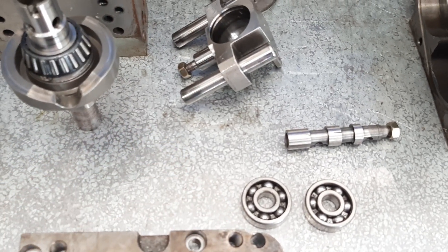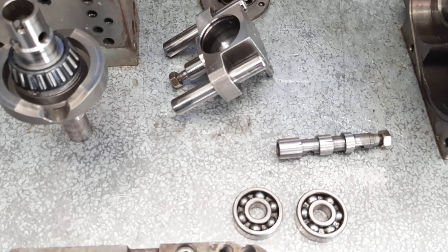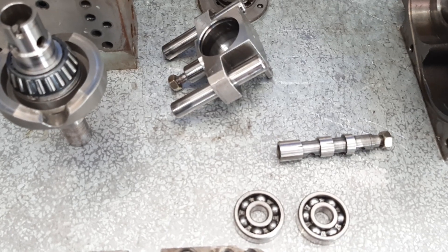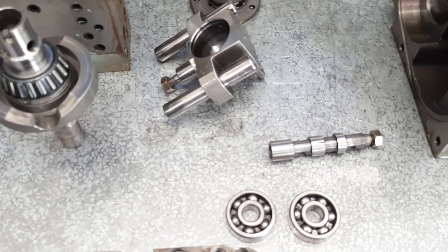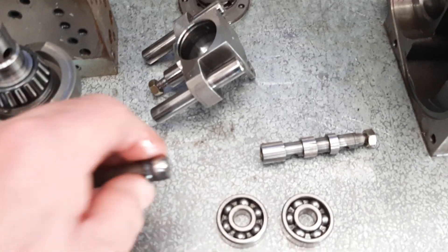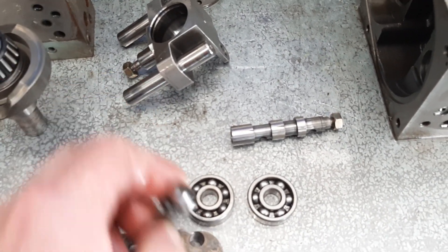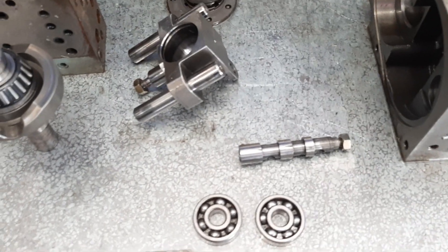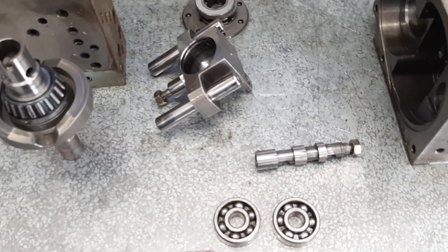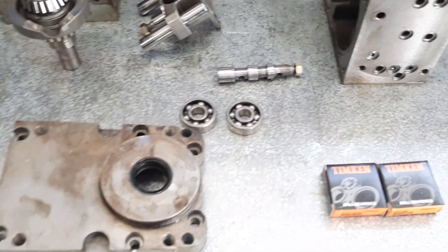There were just little bits of metal in the oil, so when I opened it all up, mostly just hydraulic oil runs in here. It's all lubricated by hydraulic oil, the whole unit's just all hydraulic oil. I just replaced those couple of bearings. As soon as I see bearings, I always like to rip them out and replace them.